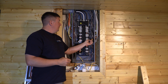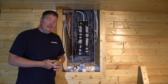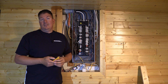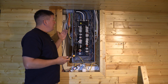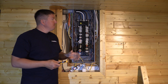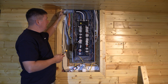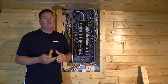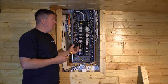We found in here that some commons were powered unfortunately, and the grounds aren't hooked up in some of the electrical boxes, so we're doing a lot of work to fix this. As a suggestion, if you're ever wiring anything, keep your grounds and commons separated, and keep your hot wires organized so everything is neat. If you ever have to get back in and work on it, you don't want to worry about what wires you're touching.